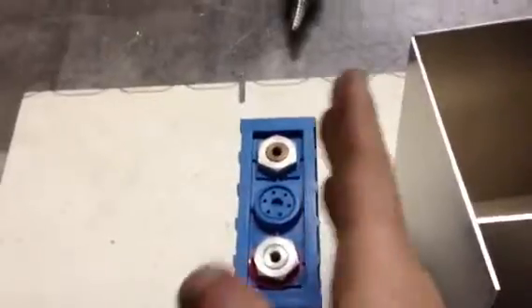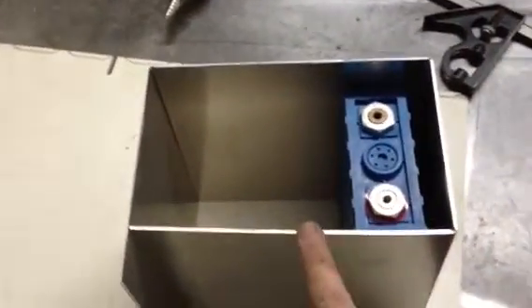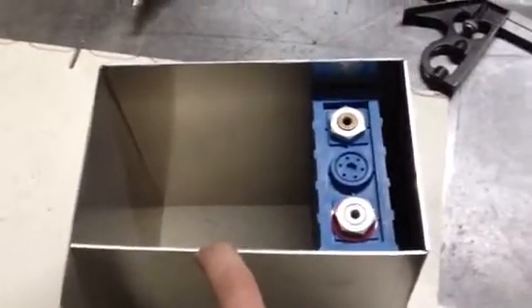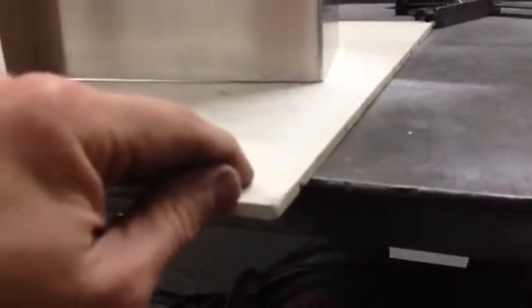The general layout is such that I'll have four of these sitting next to each other inside of this box. I've made it out of some scrap 0.080-inch aluminum, which is plus or minus a few hundredths. It will also be lined inside the box with this PVC material, to provide electrical insulation as well as a little bit of thermal insulation.